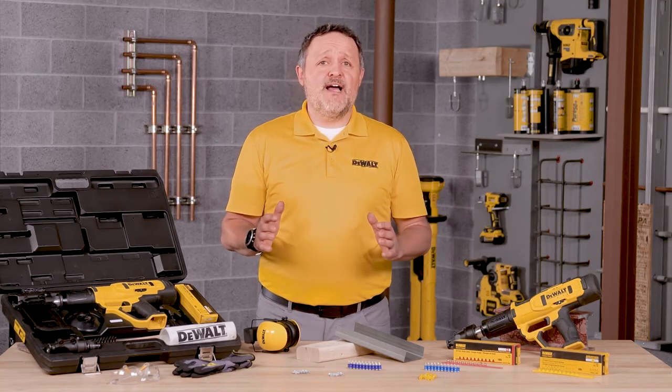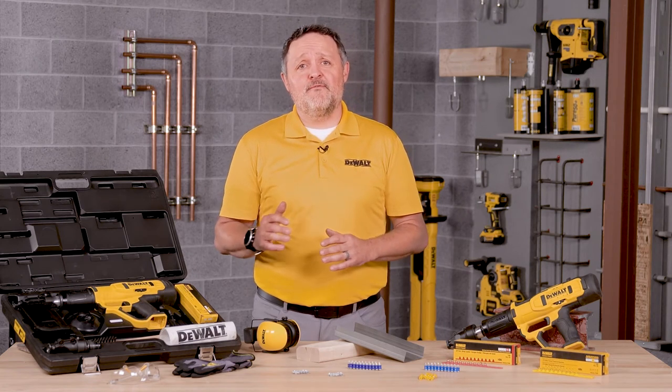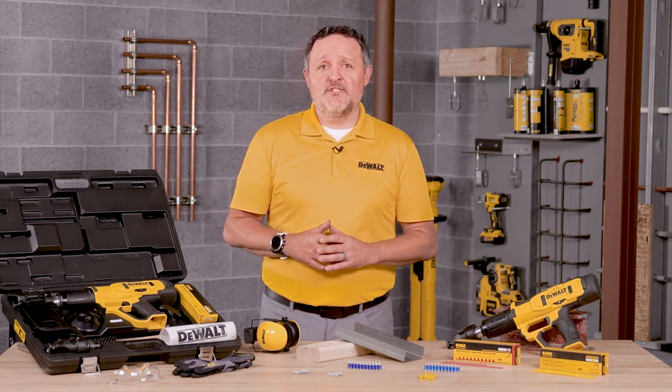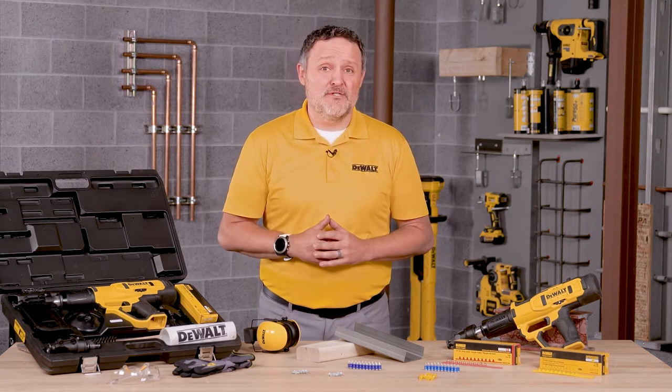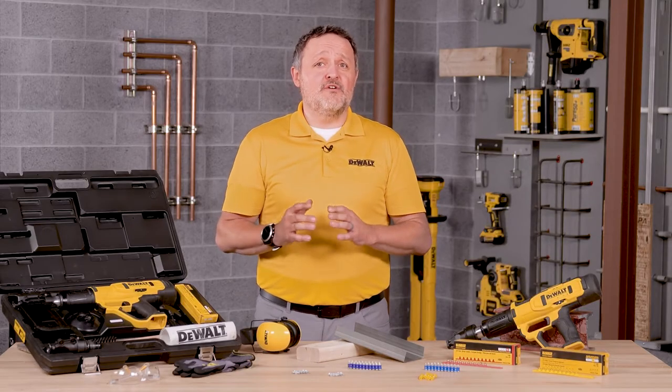Your powder-actuated fastening tool should be cleaned after every use, and general tool maintenance should be performed at 6-month intervals or after firing 5,000 loads. All parts should be cleaned with the wire brushes supplied in your toolkit. No chemicals or oils are needed to clean this tool. To maintain the DFD270, it's necessary to disassemble and clean the entire tool if dirt is evident in the breech face or if the tool appears to lose power.